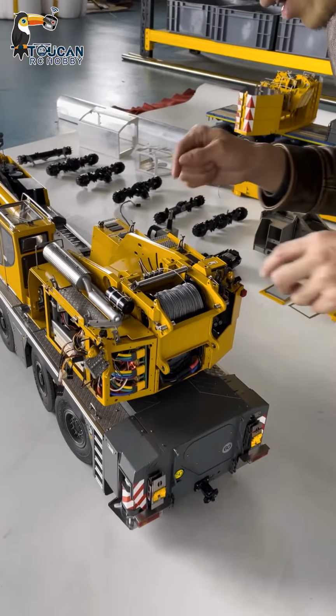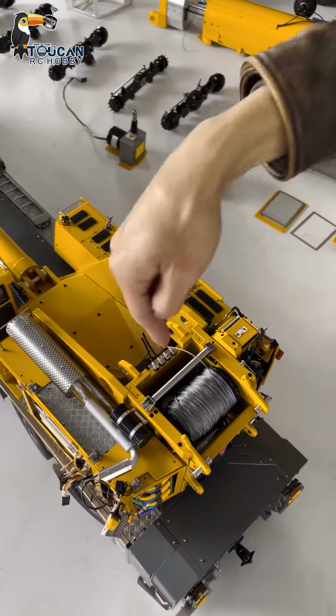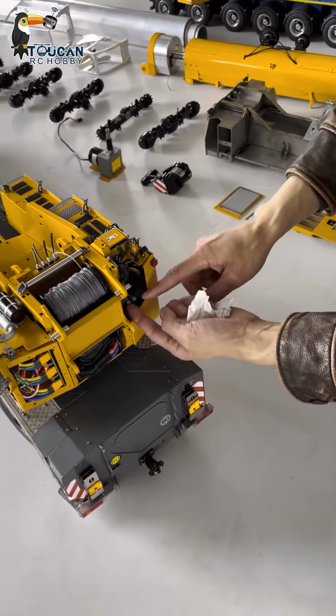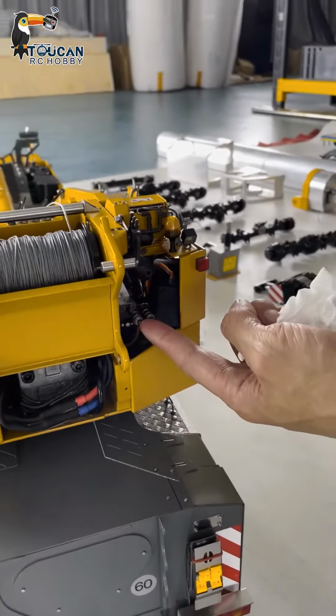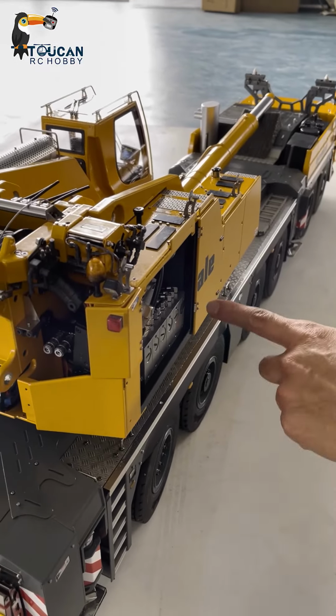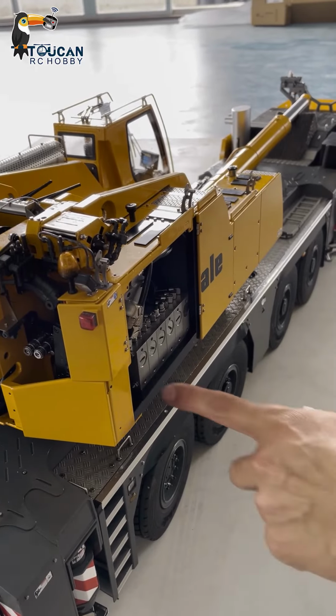And the pressure gauge can be seen from here, and the pressure release valve is also on top. So here, that's the oil channel for lifting up the weight block after the connection to the rear side of the crane to lift up, and the turning rotation to be in position. And this side from here, that's the valve block for the upper part. So 7 oil blocks, one bigger one for the main arm, the others smaller ones for all the hydraulic functions.